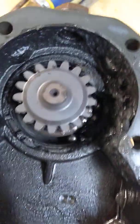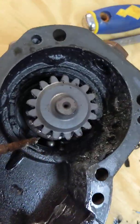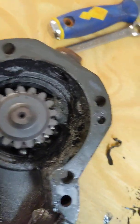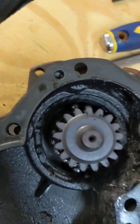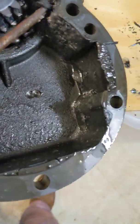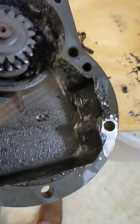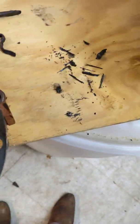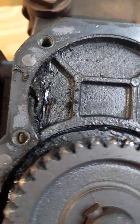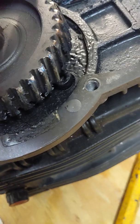You need to be checking the oil. If you look down inside here you can see the bearings — you got a single bearing there, some bearings going around about halfway, and the rest of them are completely gone. Look at all this. This unit here has very few hours on it.